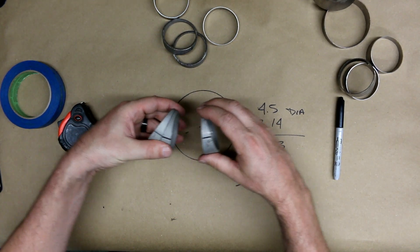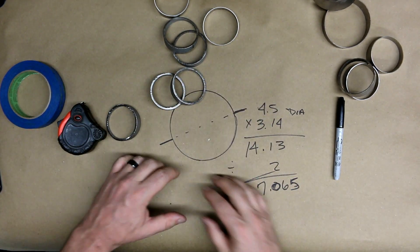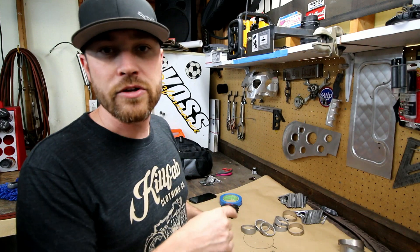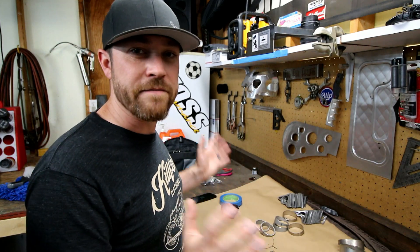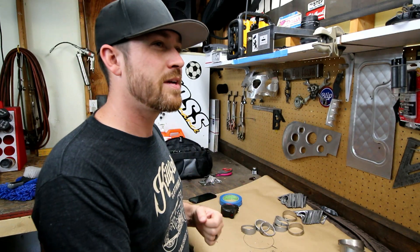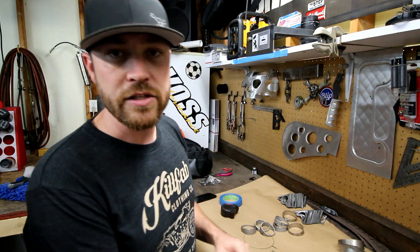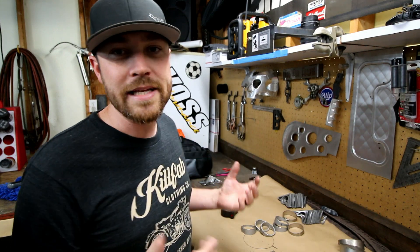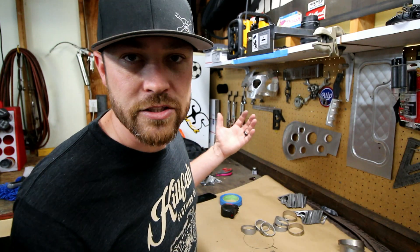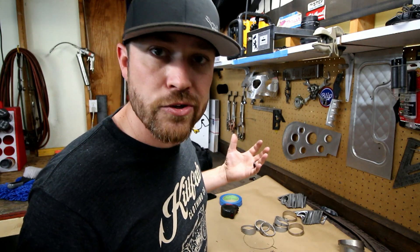Usually you'll just want to tack it together as you create it, and then once you have what you want, go back and weld it all up. A very easy introduction to pie cutting and making pie cut bends — that's the way you want to do it, those are the basics. There are some very in-depth videos on YouTube about pie cutting if you want to look into it more. I know the Fabrication Series does one — I'll put a link to that in the description. That's all you really need to know to get started and make nice, professional, clean-looking pie cut bends. I hope you guys enjoyed that. As always, thank you for joining me — I'll see you guys tomorrow. Go do work, son!